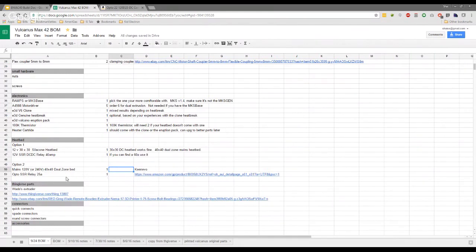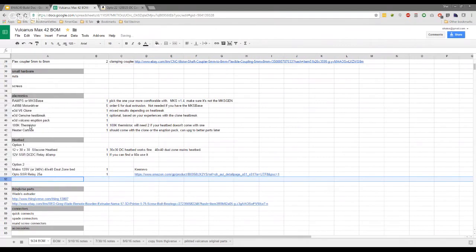All right, I think that's it. So for the heat bed, let me add one to mine, because mine actually intentionally did not come with a thermistor. To be fair, guys, you probably, like myself, have ordered so many clones for your other printers or i3s or whatever. You've probably got umpteen thermistors hanging around. I know I did. In my case, mine's an M3 stud thermistor.